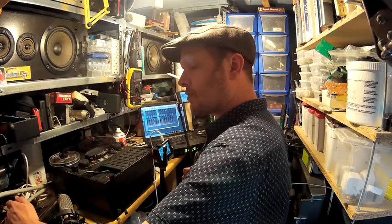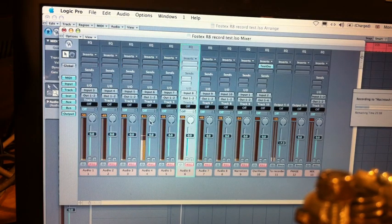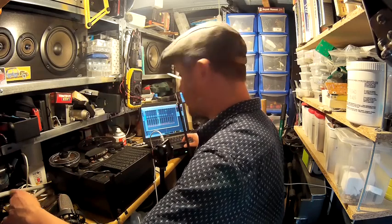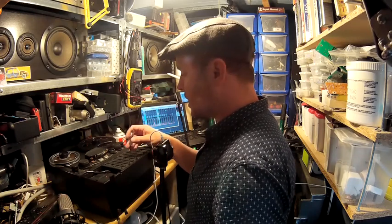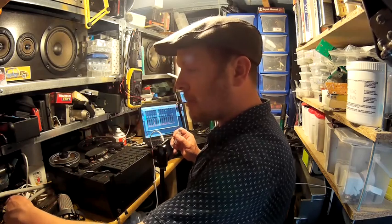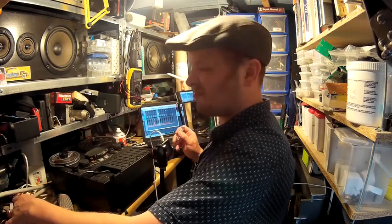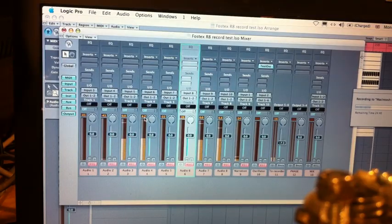Record a few seconds of that, back to the beginning. Track four is now at minus 6.1 dB and it went in at 5.5 dB, so it's actually a little bit too low. I'm going to bring it back up very slightly. As I said in the playback section, don't lose sleep over the fact that it might be half a decibel out — it doesn't matter. You may see other levels dancing up and down on the tape, but we're just concentrating on track four.